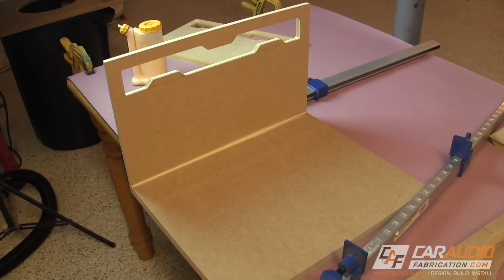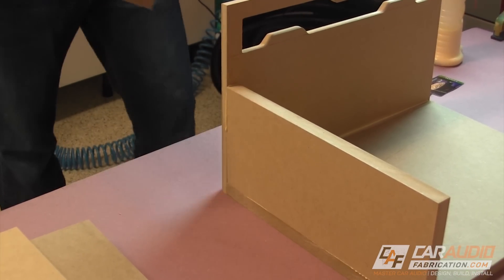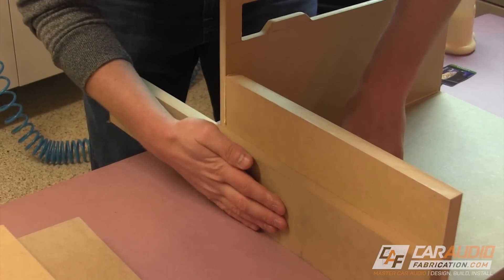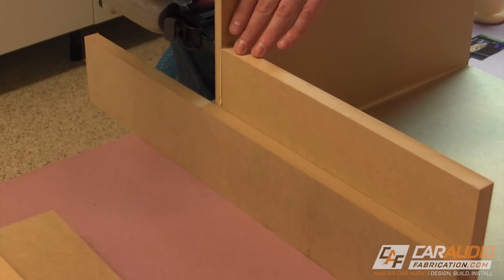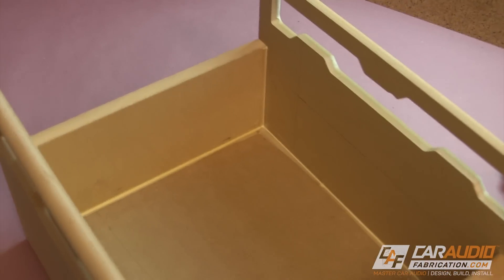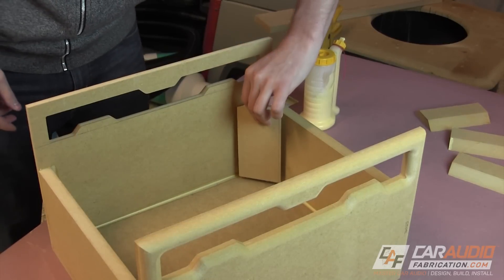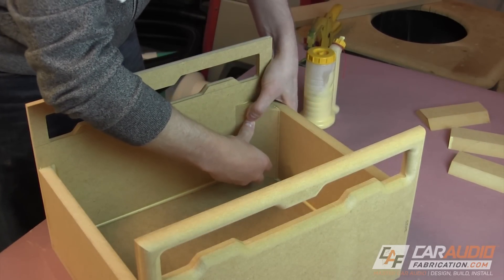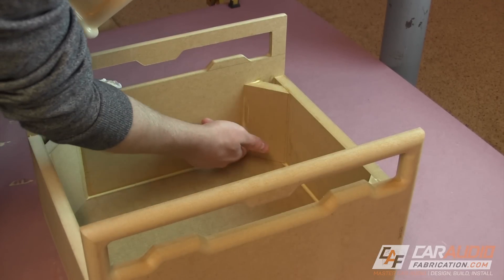You won't have to go back later and use any caulk. Next I add the side piece, and here's a cool trick: take a scrap piece of wood and put it in position at the edge of the box, then push the actual side piece up against it — this makes sure all sides are completely square with one another. I nail in the sideboard and run a bead of glue. I've now got the five sides of the box assembled. Now it's time to add the corner 45s. The corner 45s add additional strength to the corners and provide another layer of protection to prevent leaks. They do take up some volume within the enclosure, so make sure to account for that in volume calculations. In a ported box, they can also be used to help direct airflow through a port.